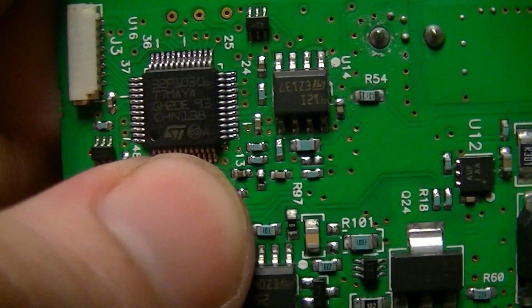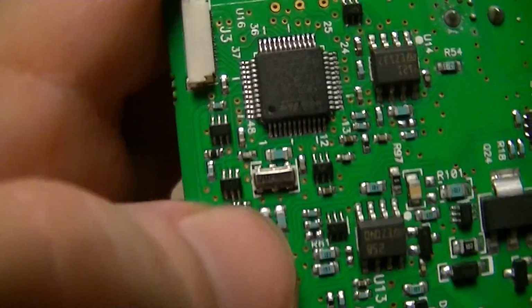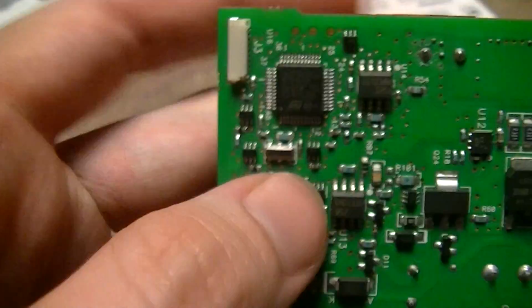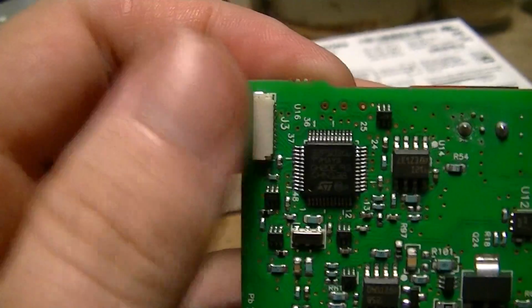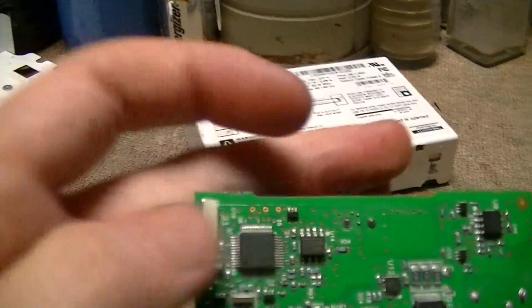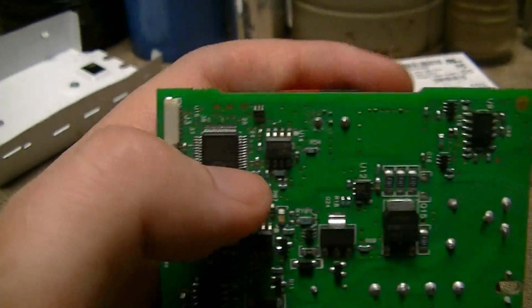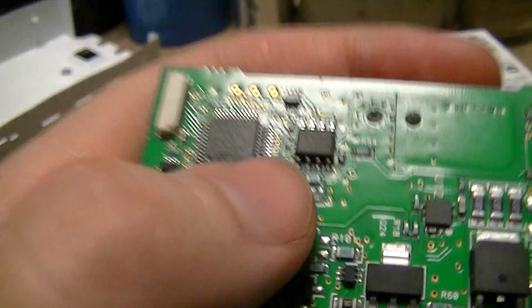I've had a bit of a cursory poke at this thing, or at least a look around. A lot of the silicon is ST Micro, but that's going to be the main charge controller, or main controller device. That J3 is probably just a JTAG ICD port, because it's not externally accessible, and obviously you wouldn't use something that small and flimsy in a building-connected application where you're going to have contractors just chucking these things in toolboxes and hauling things together.